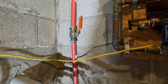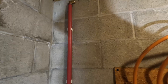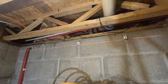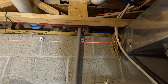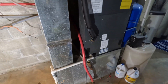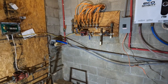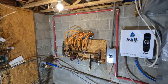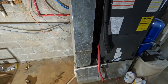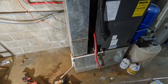That's the last piece for the day. I did have to heat some of this pipe because of the roll it was in — I wanted to straighten it out as much as I could, and it looks pretty darn good. I'm lining up my brackets with my laser level to get them nice and straight right across the top of my cinder block wall. I have my first line hooked in — that is a direct line right from the wood boiler, the hot end, one line already ran. That 1-inch PEX when it's in a huge roll is very, very hard to bend, so you have to heat it and kind of hold it.